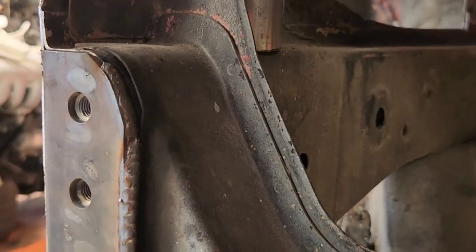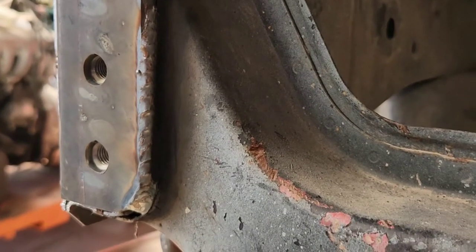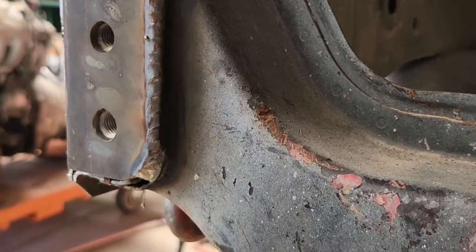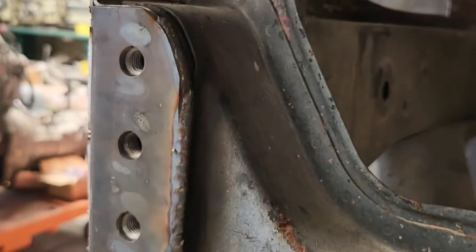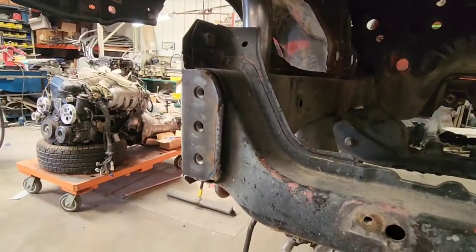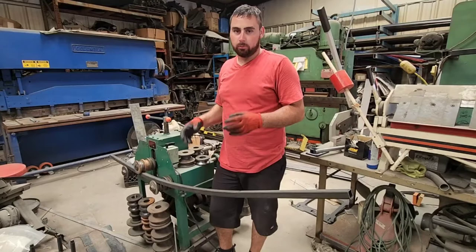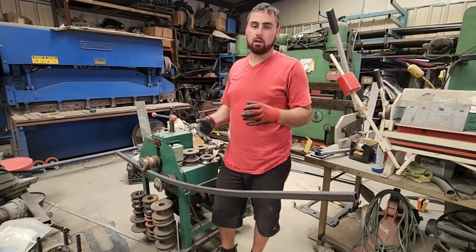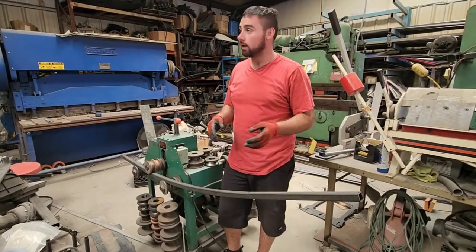Yeah, so we just bumped that weld going all the way down there. You'll notice that I was pulsing the trigger. That's just because I didn't want to get too much weld on there, too much filler, and it drip. We're going from thin to thick material and just trying to balance it all together nicely. We've got our splitter set at the level that we want. So now we have to build bracing for the splitter so that it supports it fairly evenly, so we don't have any weird sags or breakages or anything like that.